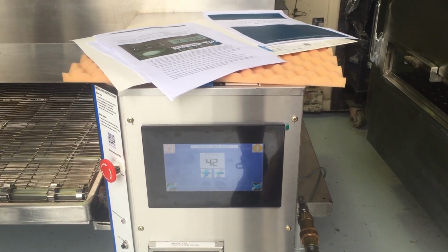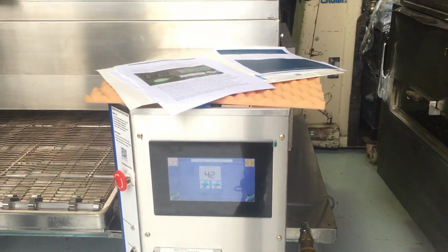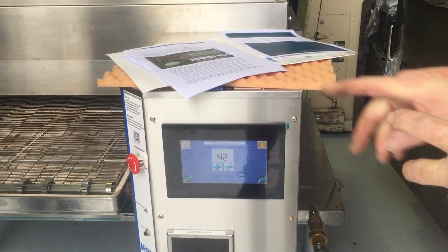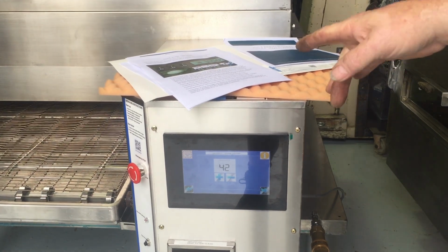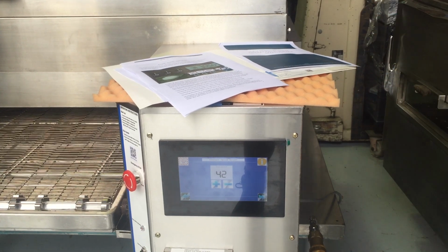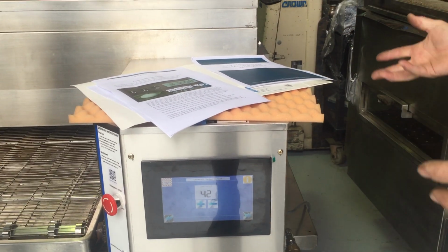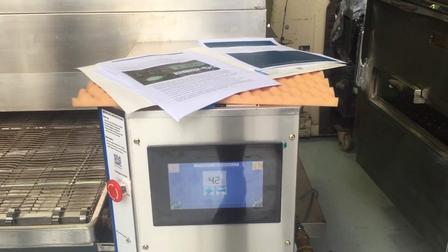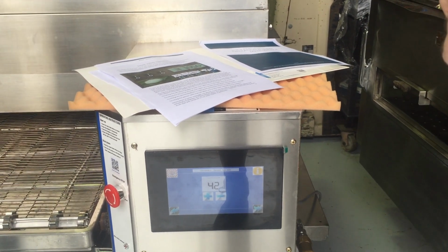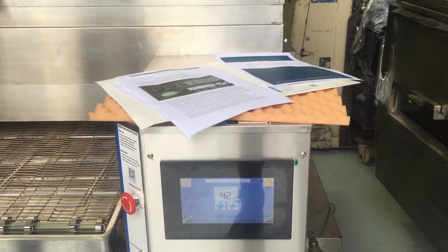The question I have is, we had an issue with this that we can't resolve. We could ring you, but I'd have to come up. You can tell me what that maintenance screen says. I've actually had another one of these that I sold where that came into play. The ignition module was playing up, and it would break down on a Saturday night. I'd come there and there's nothing wrong with it, so I'd go away and he'd ring me. So I said, when it's doing it, video this maintenance screen and show me what's going on. Straight off, I knew what it was and changed the ignition module. All good.